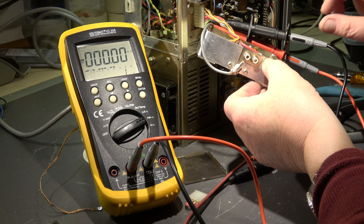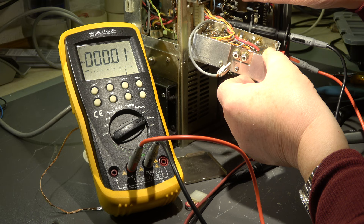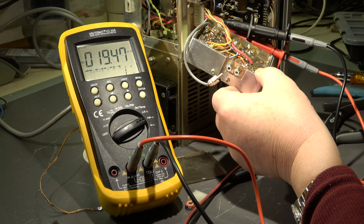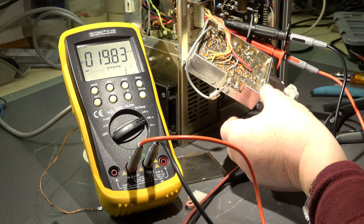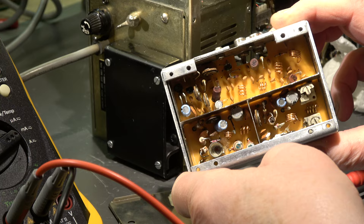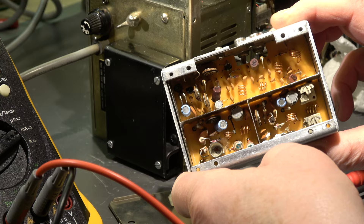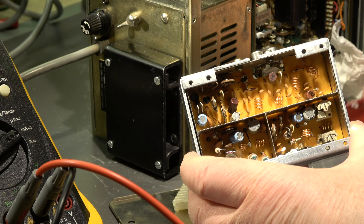What is this? I have no ground connection — when I move it, that's the reason. Here — no ground. When I squeeze it down, no problem. I can now set the current to a higher level and adjust it. By the way, I cleaned it inside, and now I can glue this diode to the heatsink of the driver transistor — a small diode here — same procedure as I did before on the other PCBs.